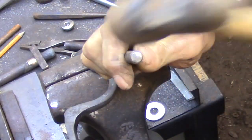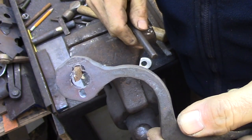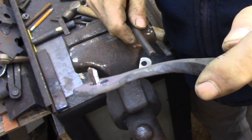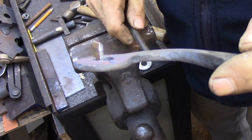Here I'm tightening up the fit by driving a chisel directly next to the opening. That's pushing a chip up against the keyway and jamming it in place, so hopefully it'll stay in the fire while I braze it.